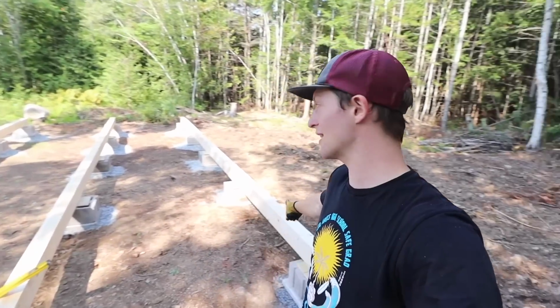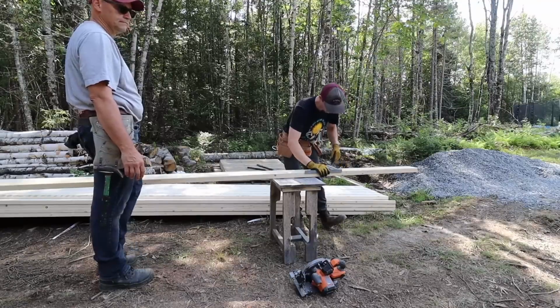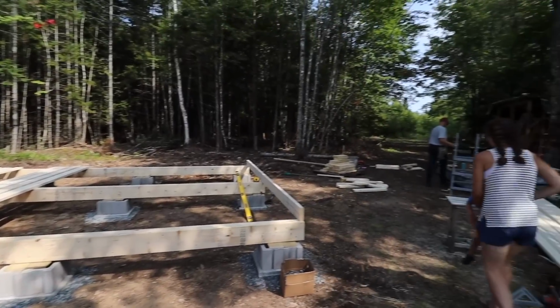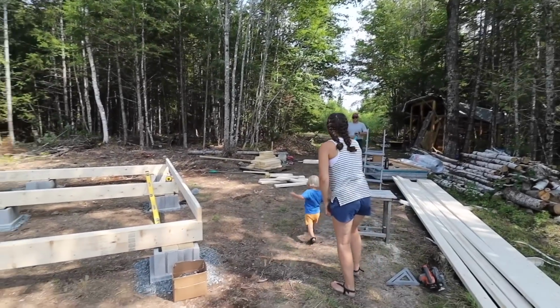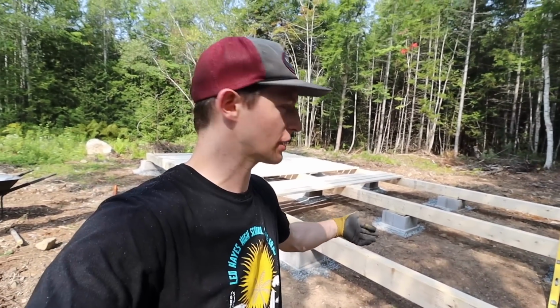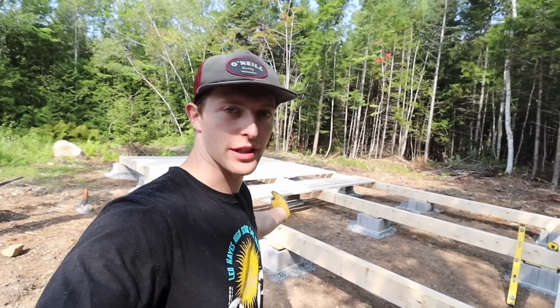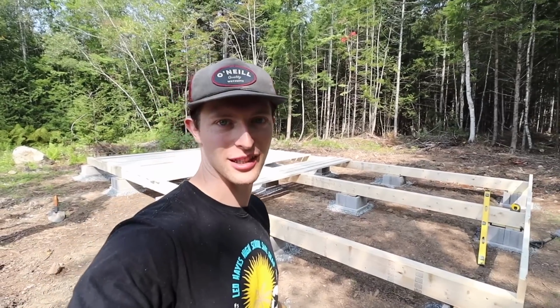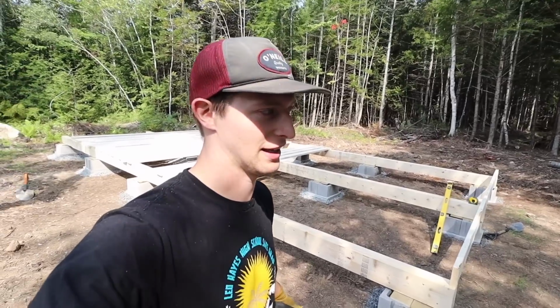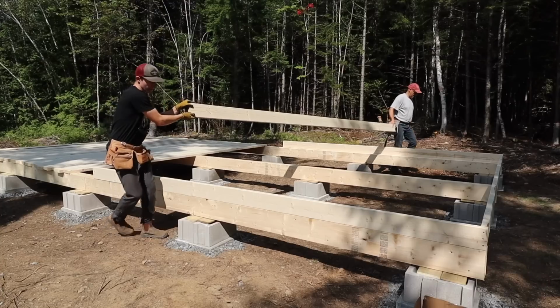We officially have all 3 of our beams complete. It is time to start cutting our floor joists. All right, everybody, we have all 22 floor joists cut. Now we need 4 rim joists for the 28-foot fronts and back, but it's time to start getting things laid out, trying to get things as square as we can, and time to start hammering the floor together.